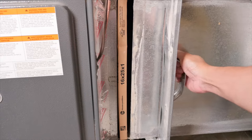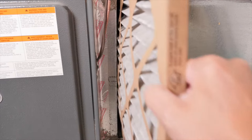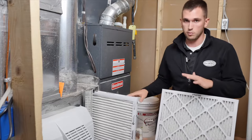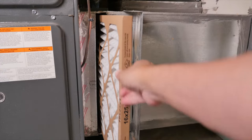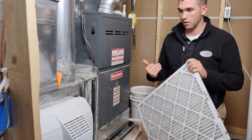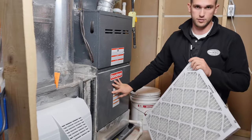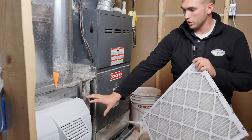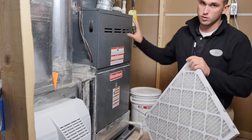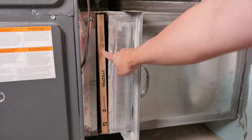To get started, simply locate the filter door connected to the air handler. If the furnace is running like it is right now, it might be a little bit tougher to change, but that's no problem. Just make sure that when you're putting it in, you're careful not to bend it. What's important here is the airflow. Where you see the duct line running into the air handler, the air is flowing through the filter into the big gray air handler. That is the direction that you're going to put your airflow marker.